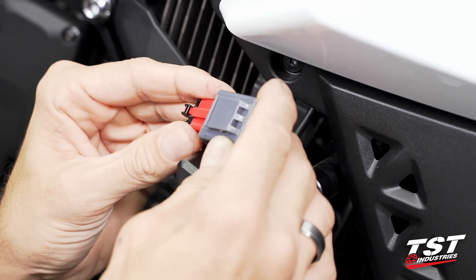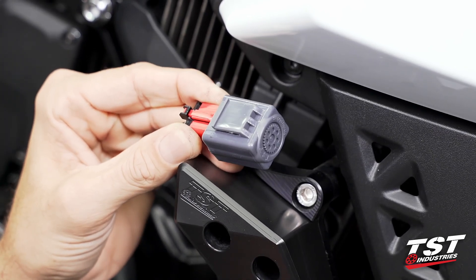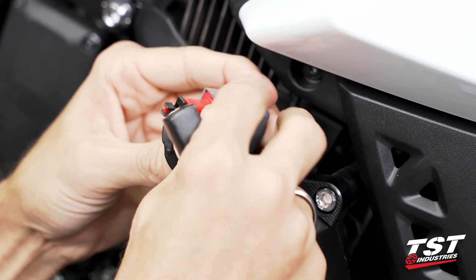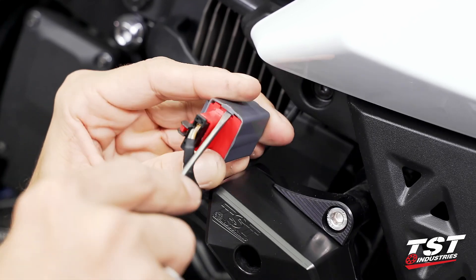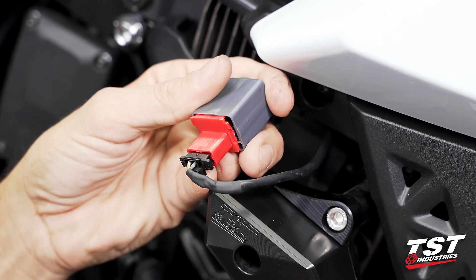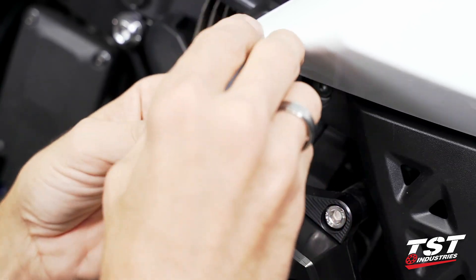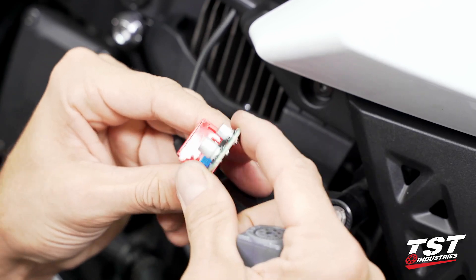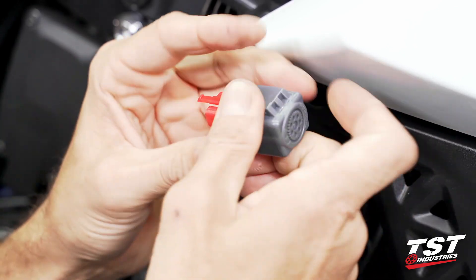Our adjustment process here will be portrayed in a model-agnostic way — applicable to any model out there. I typically like to start with my relay still plugged in. I rotate it to find this area here and pry it up with a small flathead screwdriver, basically prying out the red portion from the gray cap. Some of our other relays have a different color connector portion so they won't be red. When you leave it plugged into its connector, the gray cap will generally come off and the circuit board will still be in there. If for some reason you cannot do this with the relay plugged in, the procedure will be as follows.